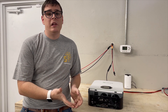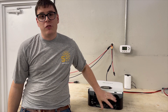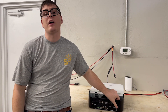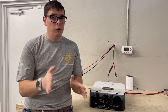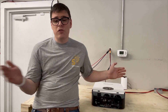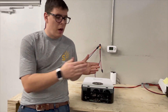It's a quick and easy way to destroy your inverter, and it's something we can identify when reviewing warranty claims. Keep that switch off when working with batteries, wait until you see the correct voltage on the bus bars, then turn the switch on. Take this process slowly, do it right, and nothing gets broken. That covers the general parameters you need to consider when designing a system around this inverter.